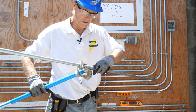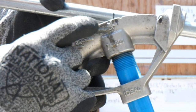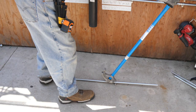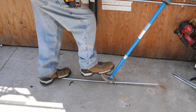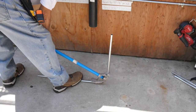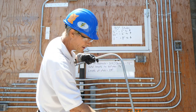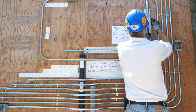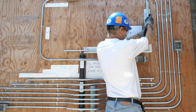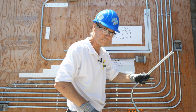See, the little point of the star is right on the line. Hold that real tight. Put your foot on the back part of the conduit, put your boot on the heel, and just nice and slow and steady — we're going to go right to 90 degrees. You can measure this when it's on the ground — it should be 16 inches here to here — or you can just put this right in the middle on the board and mark it. Either way works.